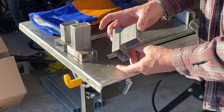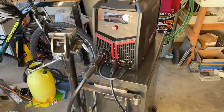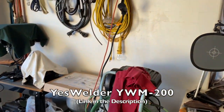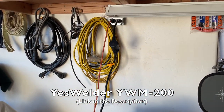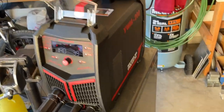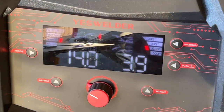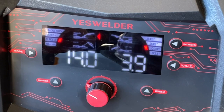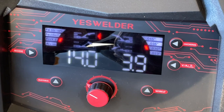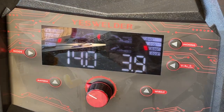Be careful — there are some cautions you need to take when welding galvanized steel. Do what you need to do to do this safely. I'm going to be using the YesWelder YWM200 machine on 120 volts. I started at 14 volts and 3.5 on the wire feed speed, which is recommended by the literature, and my final numbers were 14 volts and 3.9 on the wire feed speed, which is about 150 to 160 inches per minute.